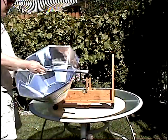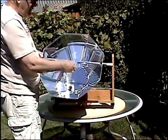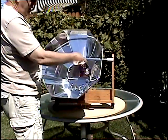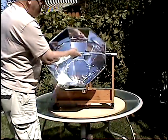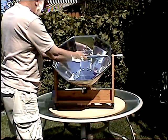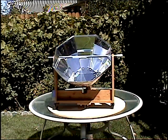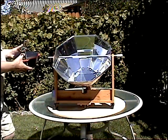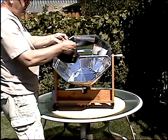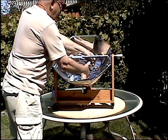The reflector is made from 20-gauge aluminum. It's eight-sided and the aluminum is polished. Through the reflector is a one-inch aluminum tubing that's used to hang the reflector from. The Dutch oven is painted black and it's hung from the tubing.